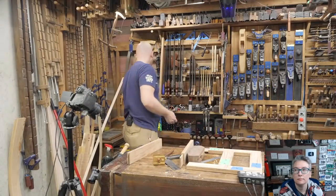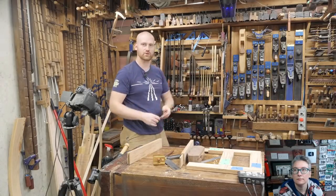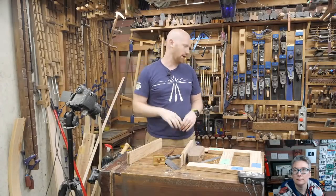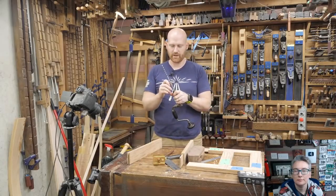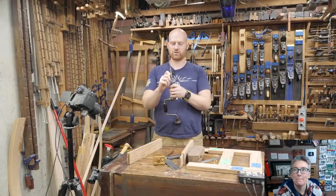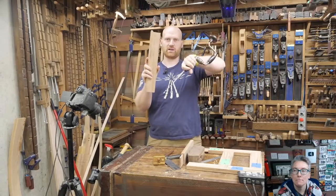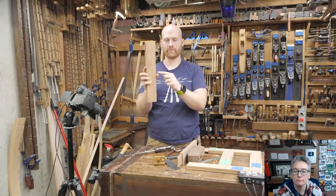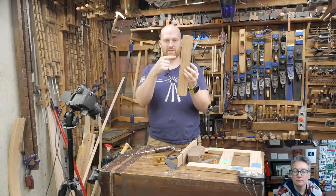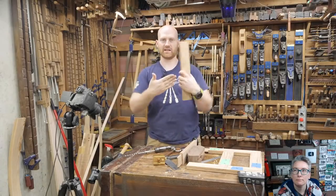I'm going to try something a little different today. Several people asked why not bore it out — I want to show a different method. Here's the problem: a quarter-inch bit needs to go straight through the board, so if it tilts at all we have problems. The way you fix that is you only go halfway in from one side, then come around and go halfway from the other side — drilling about five holes each side coming halfway through.